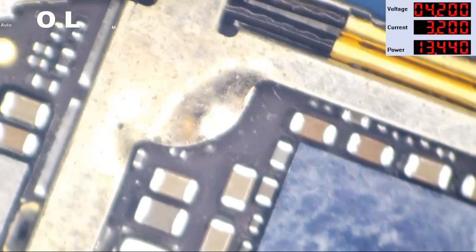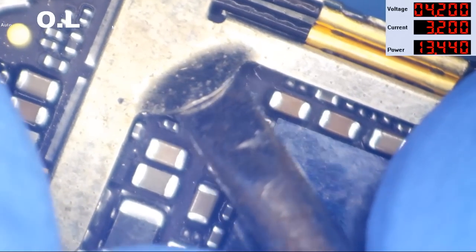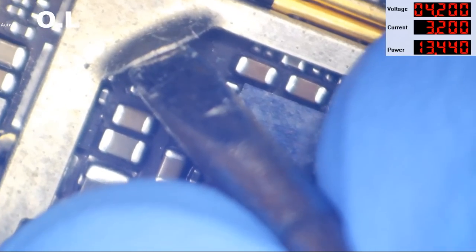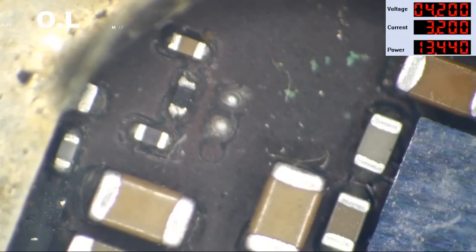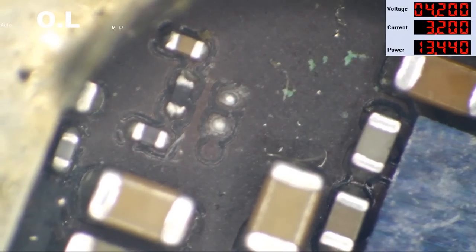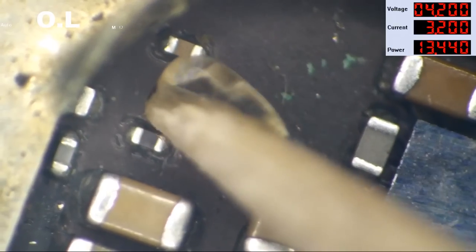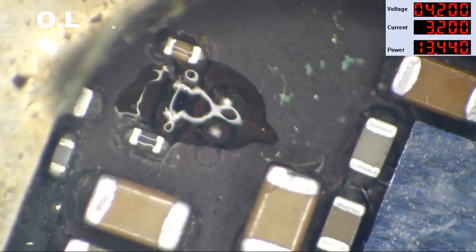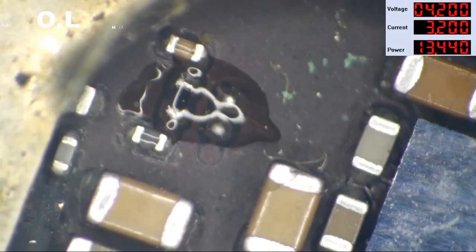To eliminate the backlight driver, we need to disconnect I2C0_AP_SCL from it. On the back side of the board we have R4021. Remember we already had some pry action going on there — now we're getting a better understanding of why the last tech had been prying around on this. We pull that up and find probe marks on it. We don't care about this component anymore — let's disconnect this line from the backlight driver. Measuring it: also a 1K resistor. I don't think this is going to do it, but let's do it anyway.